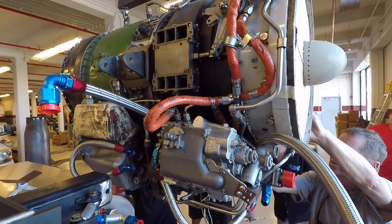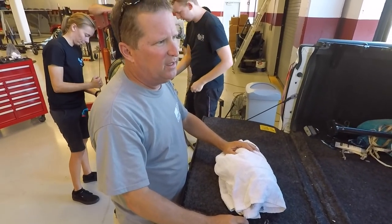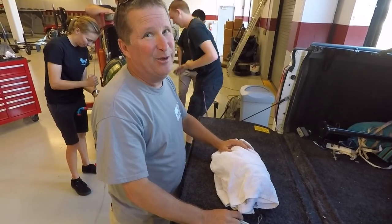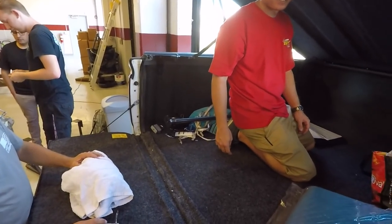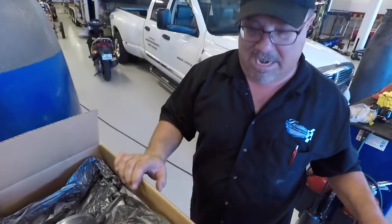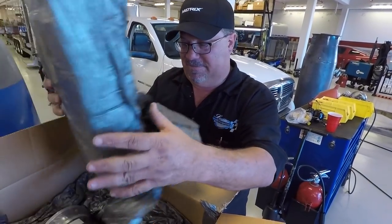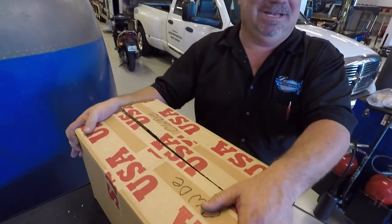The engine is about 360 pounds. We'll put the afterburner in the cab to protect the good cargo. We've got a brand new starter - no hot starts. If it does get hot, you sacrifice the starter to save the engine. Basically, during a hot start the turbine gets too much fuel and the EGTs get so hot they can actually damage the engine. The only way to cool it off is to pull the fuel back and just let the starter run until you get it started - sacrifice the starter, don't sacrifice the engine. We have a lot to learn, but we're getting there.